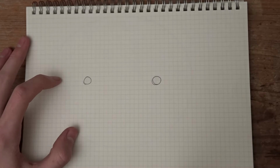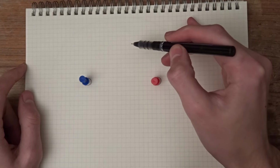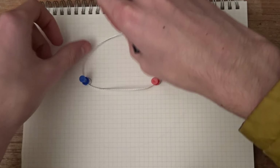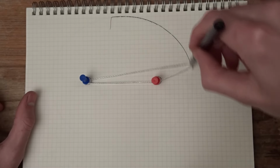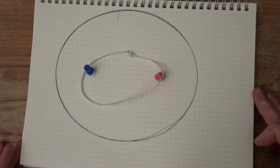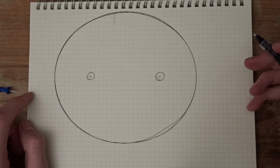If we imagine the rod and the lamp next to each other viewed from the end like this, the shape of the enclosure needs to be such that no matter which direction a photon leaves the lamp, it makes it to the rod. If we assume that whatever it's made of is reflective to light, we need the set of all points so that the angle of incidence equals the angle of reflection. Aha! We have stumbled upon an ellipse, with the rod at one focal point and the lamp at the other. How serendipitous. Now, while in theory any ellipse would accomplish this, there is room for optimization.